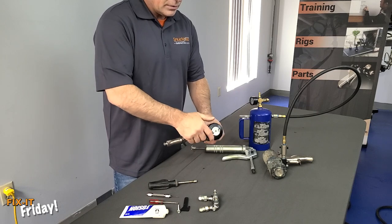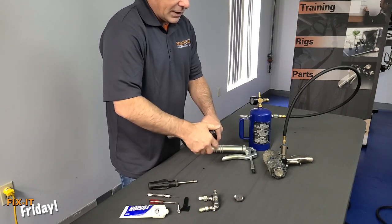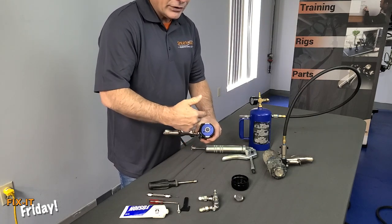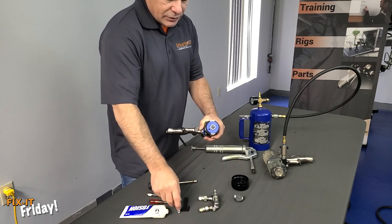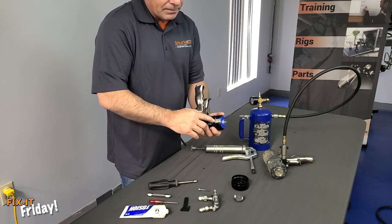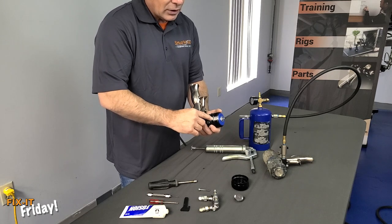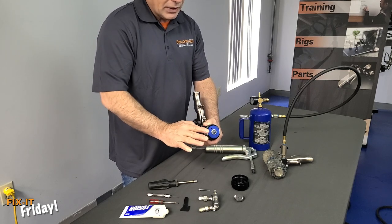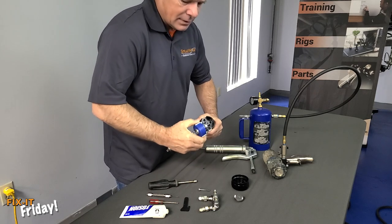Remove the air cap and take the front cap off. Typically you should be able to pull this off by hand, but after use things are going to get harder to extract. Graco recommends using the extraction tool to pull it off. In the extreme case where things are really bound up — say you had a crossover instance or you just went too far with it — you can get a wide flat screwdriver on each side and use that to pry up. But that should be a last resort. Pulling it off by hand should be able to pop off.